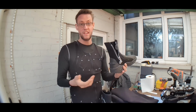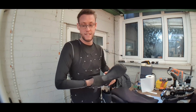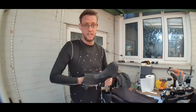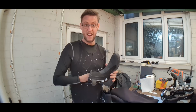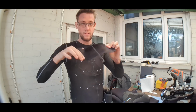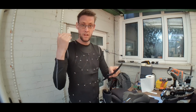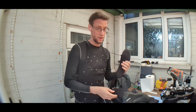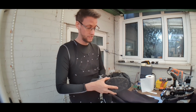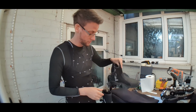effectively boots. They're very similar to wetsuit boots, effectively. The reason being is because neoprene, with the exception of the seams where the materials meet, is actually waterproof and airtight. Inside, that is a carbon fibre insole. So again, there's a carbon fibre heating element inside of that. 5 volts, 1 amp, feels like a warm bath, 40 degrees centigrade. That'll stave off frostbite in cold environments. The neoprene is also highly insulative, so it's actually very, very comfortable and warm to wear on its own anyway.